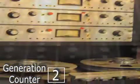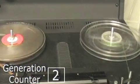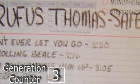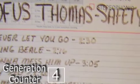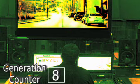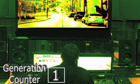When the entire session would be remixed, usually to a stereo analog master, that mix would also be one generation down from the multitrack. And if a safety copy were made from the stereo master, that tape would be even one more generation removed from the multitrack. Recording engineers were skillful in preserving a good signal-to-noise ratio through many generations, but they would always prefer to work with first generation material whenever possible.